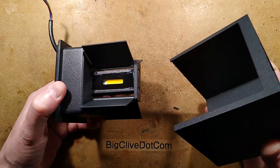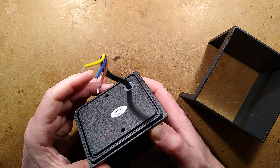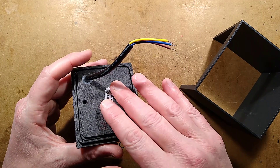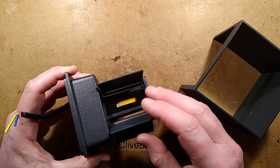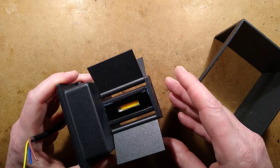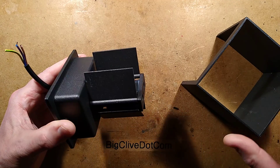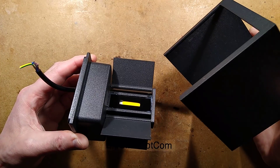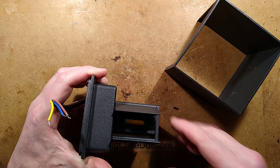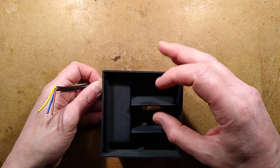So here's what the fitting looks like. It's got this metal cover that sits down over this, with a little lip at the back. The way it's mounted, you're supposed to make a big hole in the wall and stuff the terminal behind the wall or into a proper junction box. Most of these things have such a small area to cover that you need a small junction box. The COB is covered with a piece of glass, and it's got these little barn doors over those to shape the beams. Then this metal cover simply slides over and gets trapped between the lip and the wall, which makes it quite neat — completely hidden — and then you can shape the beam.